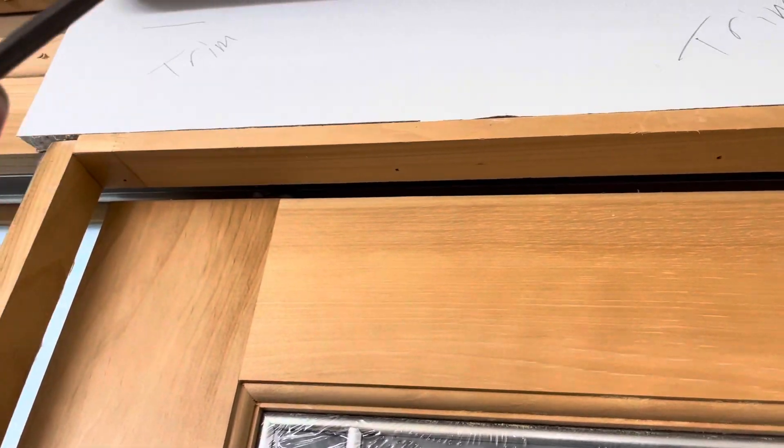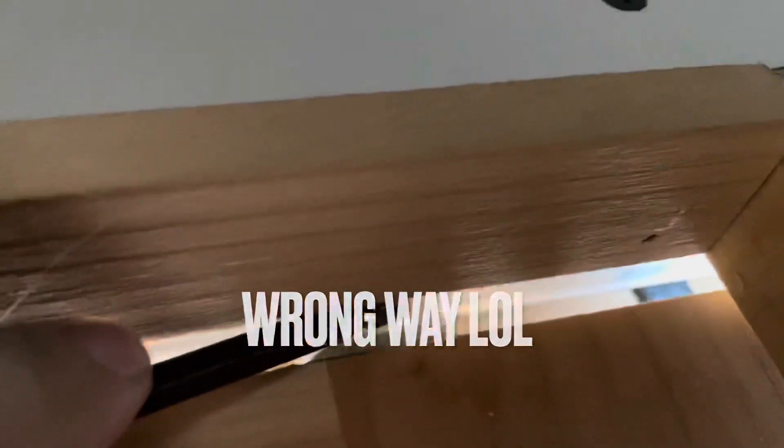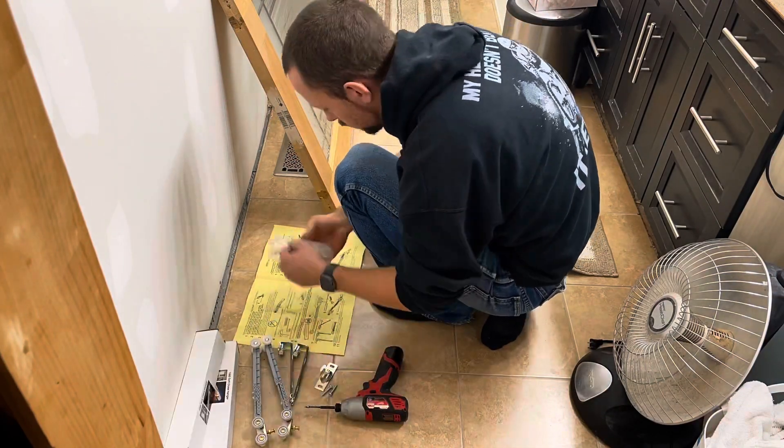Typically what I'll do is undo the rear one first, which will be on the other side of the door — just right there. And you simply just hold the door. In order to remove the hanger, you just take a prying tool — it could be anything. Pull here, push that — there you go. Sometimes it can be difficult, but that one was extremely easy. And this one here wasn't even locked in. I did push it from the other side, so maybe that's what did it. The next thing you do is lift up on the door — this is a two-handed job. Lifting up the door and moving the fasteners out of the way, freeing up the door. Next we're going to remove the old fasteners — they're no longer needed, so we can install the new door hardware that will now be holding up the door. After we get this done, we'll be installing the hangers in the old track.